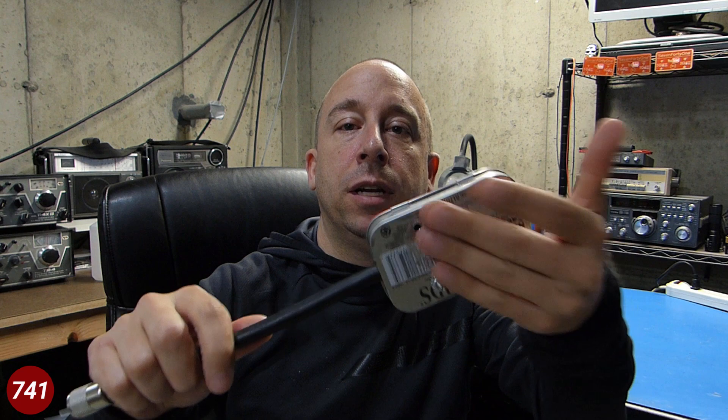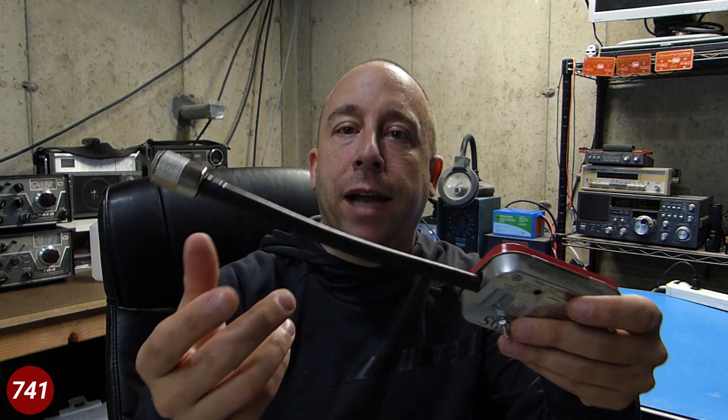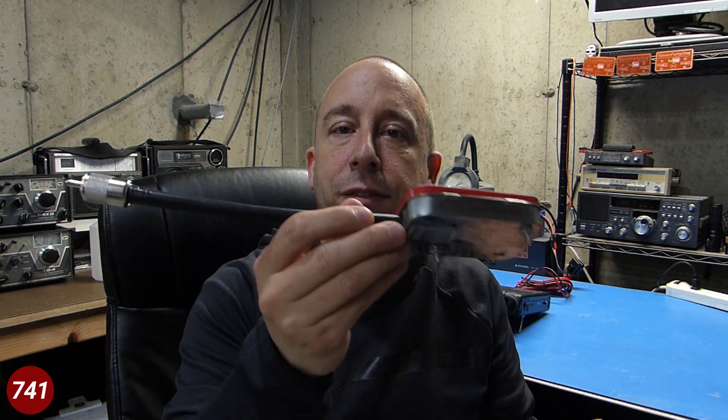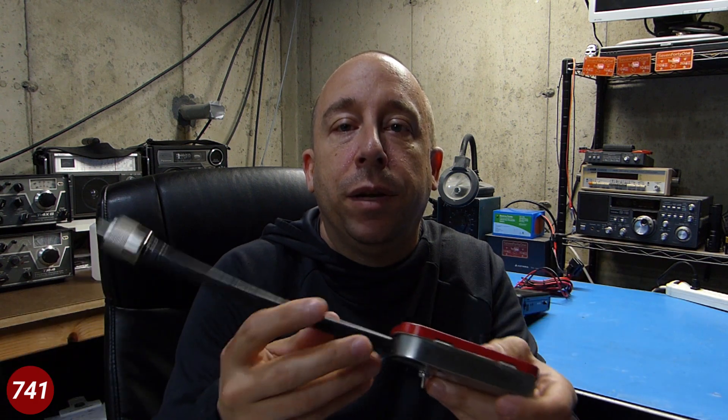I wouldn't really go more than five seconds on full power, but at a lower power — say 20 watts, which is what those resistors are rated for — I think it would be okay. A few final thoughts: I want to get the proper hardware and finish mounting this properly. If I had RG-8X it would have been better. I might shorten the coax so it fits in a go-box better, but for bench use right now this is just fine. The total power handling of the resistors is about 20 watts, though it looks like it can handle a little more for brief periods. That's all I have for today — if you enjoyed watching me build this junk box dummy load, please give the video a thumbs up, leave a comment, subscribe, or visit my Amazon store linked in the description. Thanks for watching.